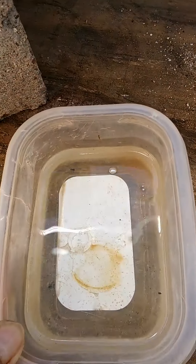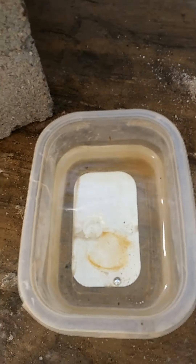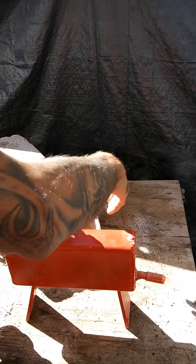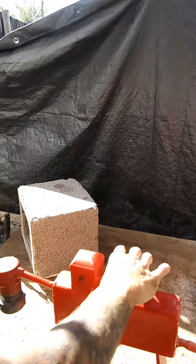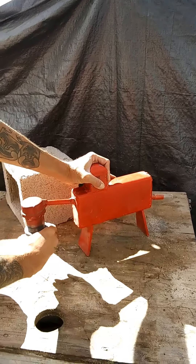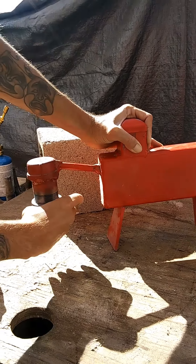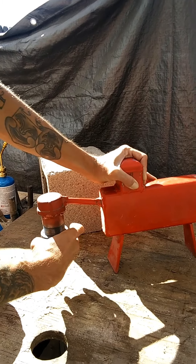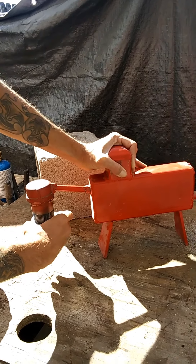So now we're getting the torch going. It's going to take about 15 to 20 minutes. After it's all done and cooled down, you'll be able to see the mercury ball that's condensed into the water chamber that we've got it catching in. We'll be able to reuse that. And then the other end, where it originally was, should be only gold. Let's see what it looks like.